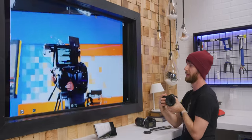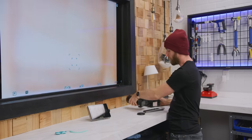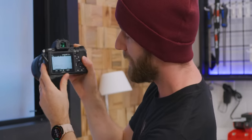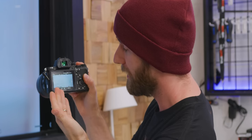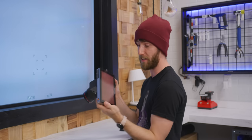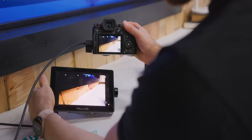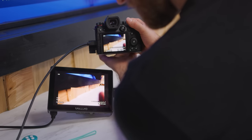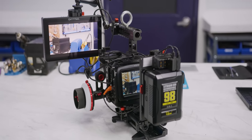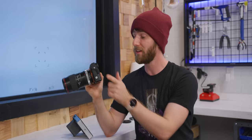TV works, cable works. Actually, this is a really important thing to bring up. You guys might wonder why exactly the fact that the micro HDMI port on this camera not working is even a problem for us here in the studio. And the answer is that while the camera does have a built-in display, usually in a production environment, you'd need a much larger one in order to make sure that you're maintaining focus. So we'd hook up something like this external monitor from Small HD. That means that every hour this camera's in operation, it's got something plugged into its micro HDMI port, which eventually, and we're talking a matter of tens of hours or hundreds of hours, not thousands of hours, it is going to break.